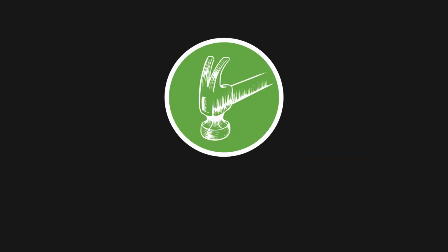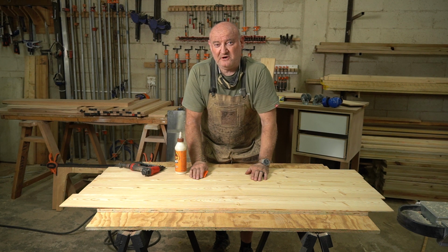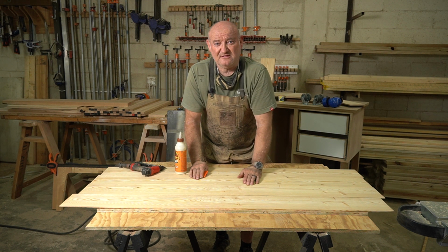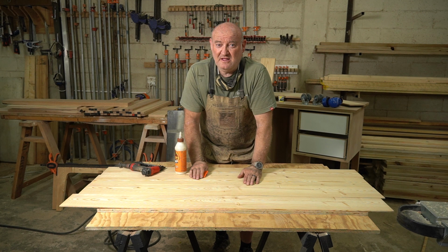We've deep sawn this wood so that it's only about 7 or 8 millimeters thick. The clever part is that it's going to be laminated or glued to the plywood that's underneath. So between you and me, it's our little secret. No one will ever know, but it'll look like a solid wood table, but it'll have some very, very clever ply underneath it to keep it straight all year round.